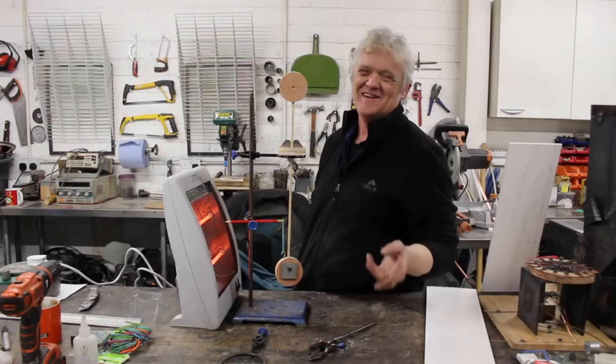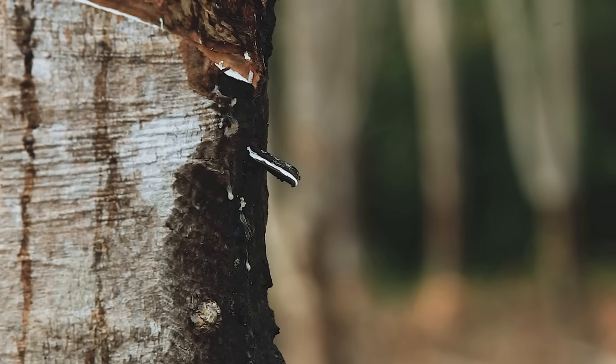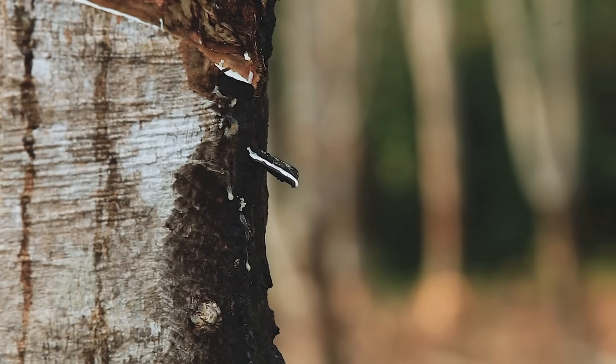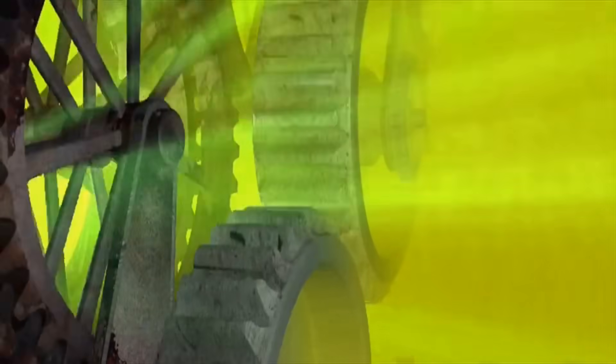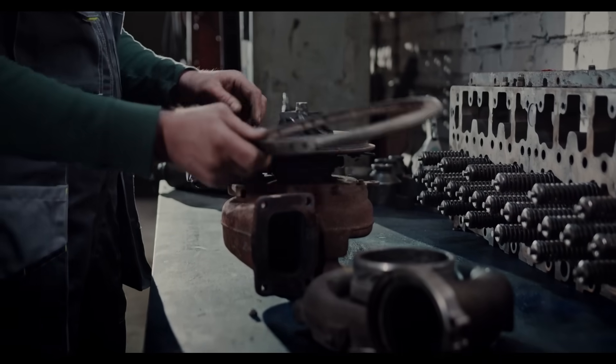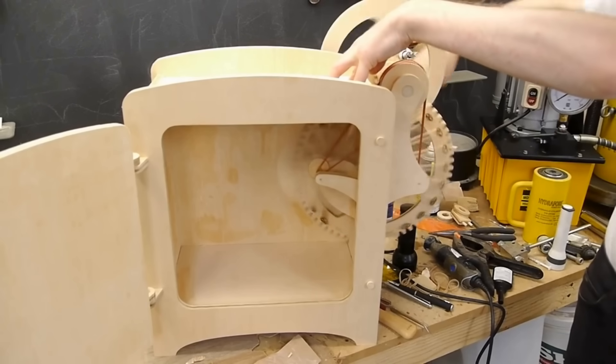So, big whoop, eh? It's a tiny movement, but that principle can actually be developed into a motor. And rubber has some surprising advantages — it's actually really power dense. Farris got 800 watts per kilo — that's about half a horsepower per pound of rubber — and that puts it in the range of practical interest. It's good for low temperature difference heat engines, there are no minimum or maximum operating temperatures, and it can operate over a broad range of temperatures. And it's a solid, so it doesn't require any containment, which means rubber can interact directly with the mechanical components and with the heat and cooling source. Rubber engines have high stalling and starting torque and fairly flat power curves. They're extremely simple to make, require few precision parts, should be easy to maintain and manufacture, and would be ideal for remote operation. And rubber is well suited to heat pump applications.